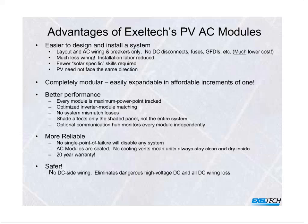So when you look at it, all of this enhances the reliability. You have no true single point of failure. Our AC output from the inverters does not pass through each other. You don't have the output of one inverter connected to the second inverter and then the third inverter in line.